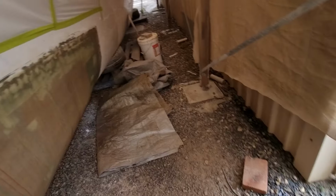We had 25 degrees here today, so it's perfect temperature for vinyl ester. As that starts to flash off and starts to get tacky, you whack your first layer on. And that first layer is put on dry. Because you've already got a wet substrate underneath, you've started to dampen the back of it, and because it's only 600 double bias, you're easily able to wet it as it's put on dry, using a dry brush to smooth it on. And by smoothing it on, you're getting a guaranteed air bubble free substrate.